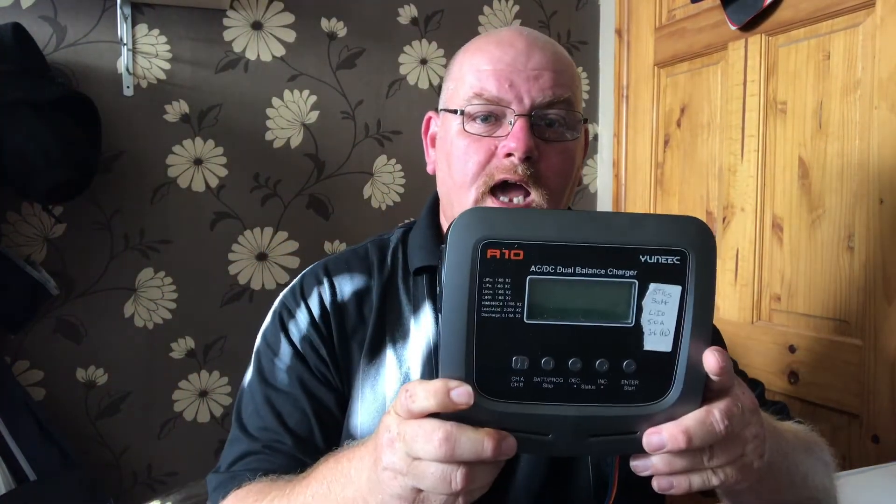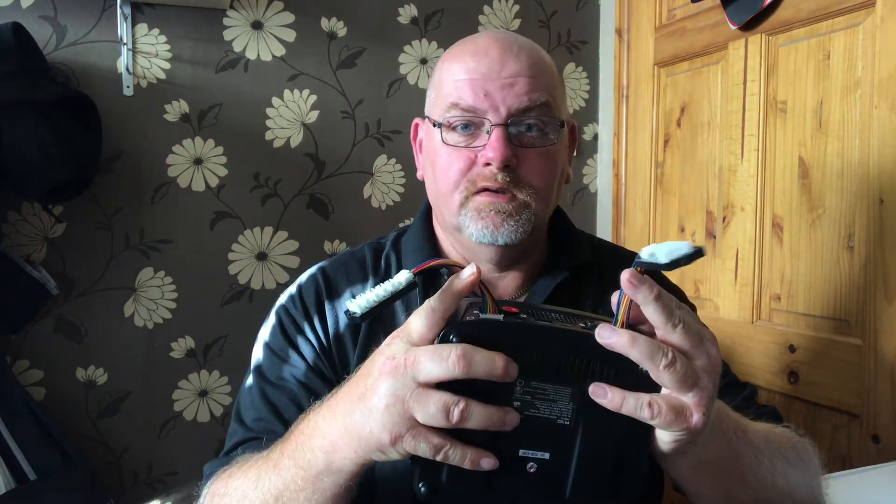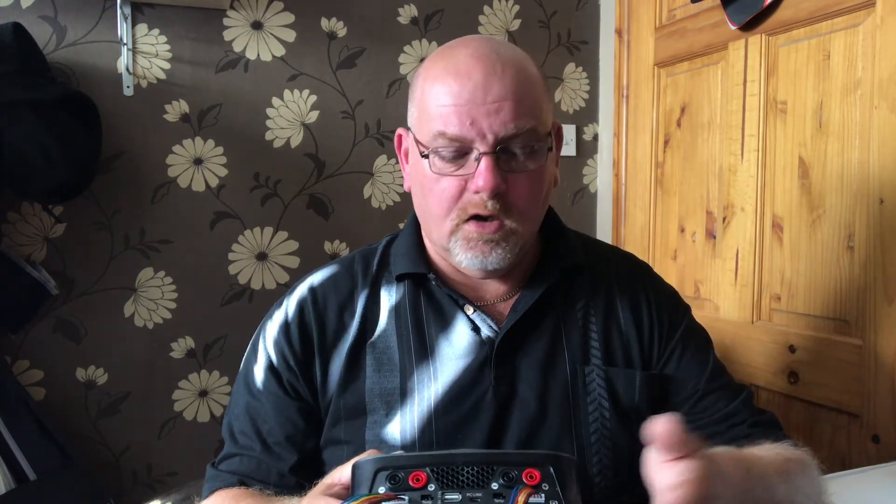So why have I made this video? Because I balance charge my batteries — I don't use the charger that comes with the copter. I use a balancing charger like the Junsi A10. It charges two batteries at once, and charges them in about an hour, so I'm getting two batteries per hour, which saves me a lot of time.